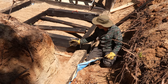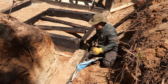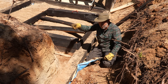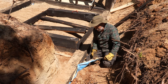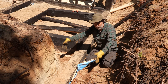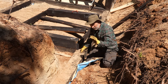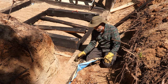Outside of this, from here — these are the outside walls of the actual basement — this part is going to be fully buried. It's basically acting as a pillar in the front corners of the cabin. So it's true that from here over, that membrane is going to hold water up against the timber, because water can still come down through here. Not much will because of the overhangs and this will be a deck, but it would still be better if any moisture like snow melt can just pass through and percolate through this sand and get away from the bottom of this timber.